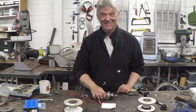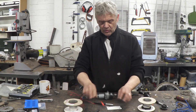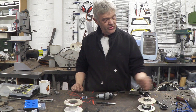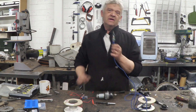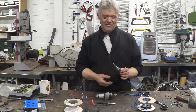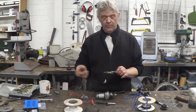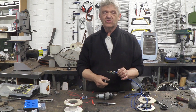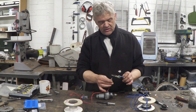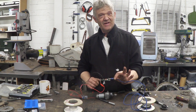That's actually really quite bright. Because what most people want to do with something like this is connect it up to a phone charger. It is a USB phone charger from my local pound shop - so I spent another extravagant pound on it. I split the case off. Now on these phone sockets the positive is always 12 volts on the center pin and the negative is on the external prongs. So there's my negative, there's my positive. If I connect that up now...